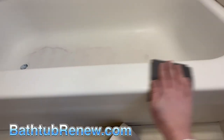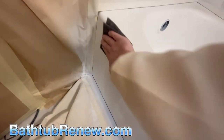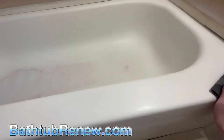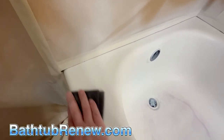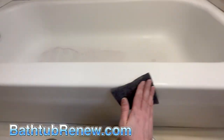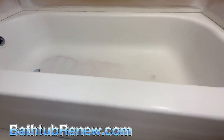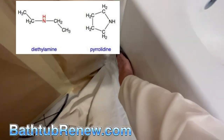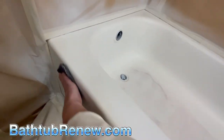Automotive primers are slow — you're waiting 15 to 20 minutes between coats, which gives more time for debris and garbage to fall into the tub. Using coatings from bathtub-specific companies is way faster, and my time is worth something. For the top coat, use any polyurethane as long as it doesn't yellow. Don't use epoxy — I don't care what anybody says, it has amine in it and it will yellow. I spray poly and my tubs never turn yellow. That's why — you choose the right product.